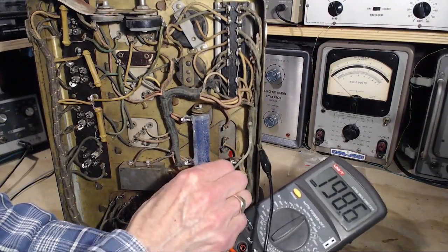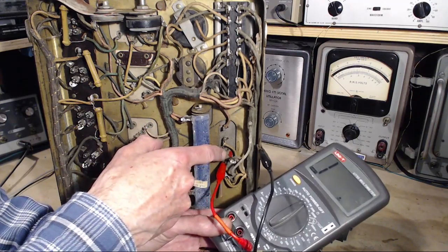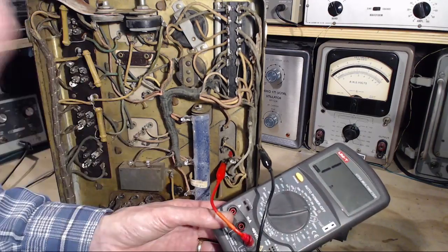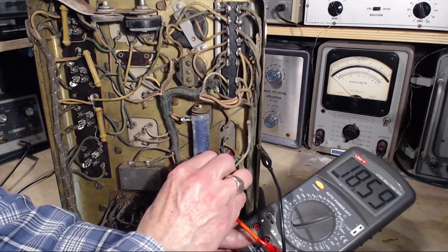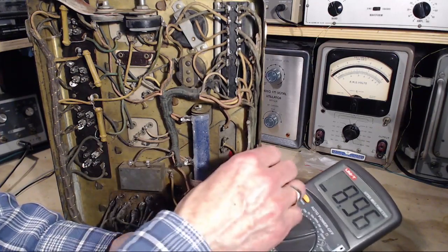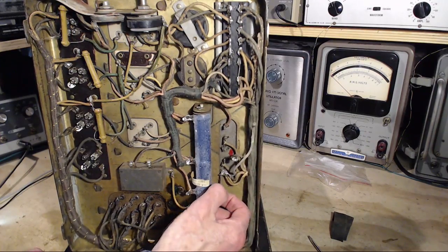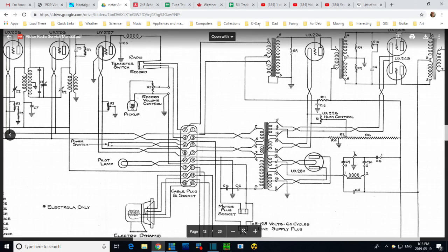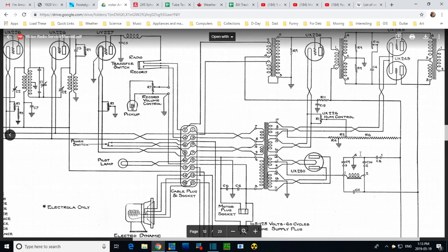Let's keep going just for fun. That's the one I think is just a ground connection. They have a red painted dot there. That's an interesting question. Why would they take time to dab some red paint there? This is showing open. Oh, no it's not. Charging up some capacitor somewhere. And that's showing a ground. Terminal number 4 appears to be grounded. So I was quite mistaken about this being the mysterious pop-up terminal. So what would the pop-up terminal be used for if number 4 is grounded?